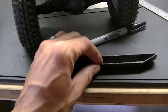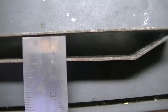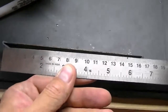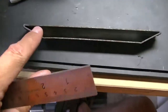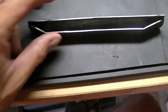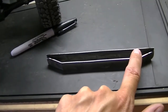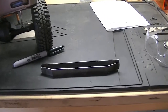I'm going to cut a piece that goes on there, which looks like it's going to be somewhere around 15mm. Yes, I'm in Canada so I'm measuring in metric — 15mm by just under 18, so 17.5mm. I'm just going to cut it rectangular, tack weld it front and back, and then zip these two edges off and finish weld it. The next piece will be the bottom, and I'll make it rectangular too — the width of this bend, coming all the way back. Tack weld that on, weld another piece on, grind it all down, and Bob's your uncle — I've got a bumper.